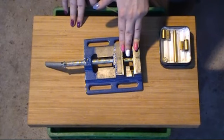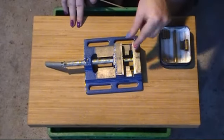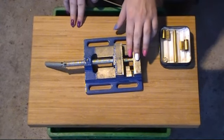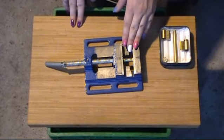The more it is, the more wiggle room there is, but I have very short key pins under here, so I don't want to cut it as long as the whole height of those key pins, because then they'll jiggle loose in here and I'm worried about them turning sideways inside the lock. So the goal is to not give enough room for that to happen, so you only really want a couple of millimeters, nice flat there. It's just so that there's some airspace underneath the sheath when it's installed.